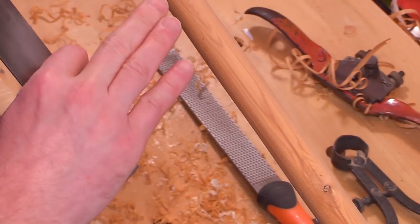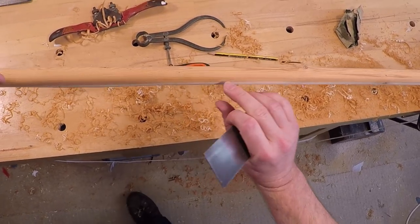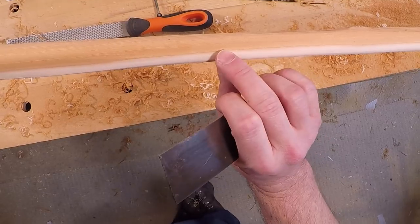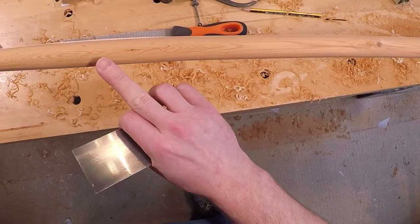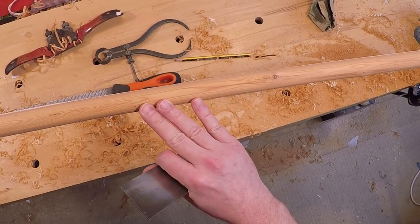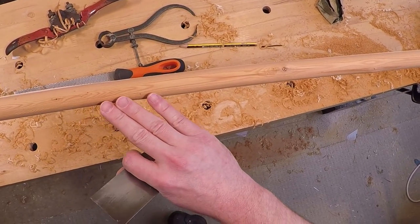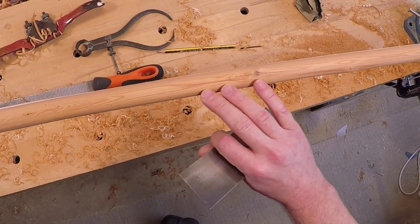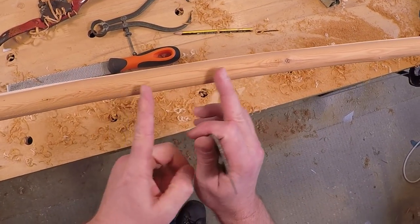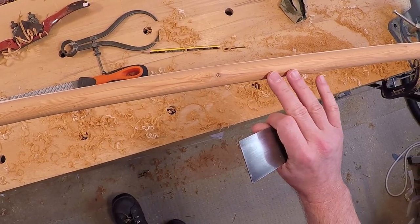Now if you're wondering what I mean by this, these rings, depending on the growth of the tree and its growth rates, will hopefully be equidistant between each other. As you can probably see on this, it's a very tight grain. This is a particularly dense piece of wood. So these growth rings should be even throughout its length because it's a self bow. We haven't destroyed any of the shape of the bow by adding any other wood. So potentially, by moving with these rings and making them an even pattern throughout the bow, making them evenly layered by the distance between them, which is really done by eye, you're not measuring it as such, we can hopefully get the bow even depth